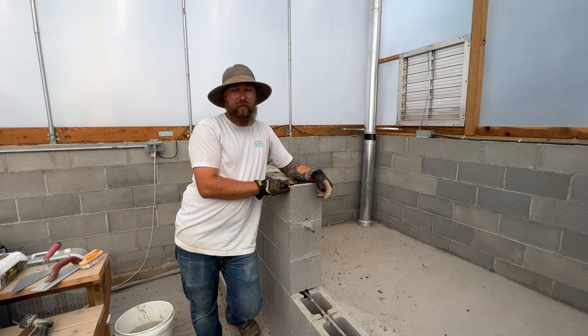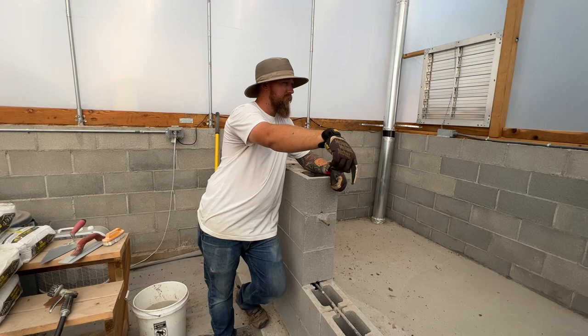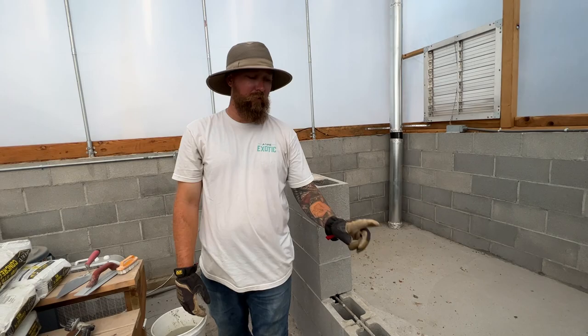And then we are also going to get some half-inch foam insulation, like just the boards. And we're going to cover the whole inside. We're probably not on the bottom, but on the sides. We're going to cover it in that insulation. That'll just make a smoother, better surface for the fiberglass to sit on so it's not all bumpy where the mortar lines are and stuff in the pond. So we're gonna mix up some concrete, get these all filled up, and then we'll figure out what we gotta do to get the blocks put on.